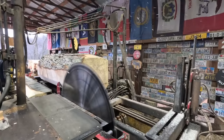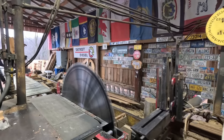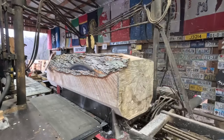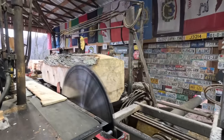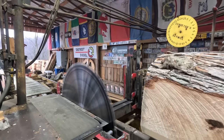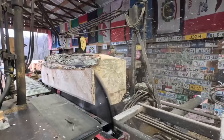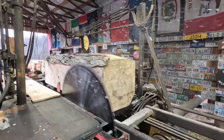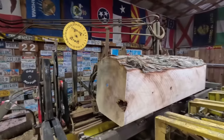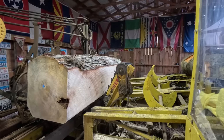There's been very little waste on this log, really. I think this run's going to take me down below my 22. That's a lot of log. I think we calculated over 300 feet. Okay. We're going to get into some rot right now. Well, let's run that front out again. All right, we're gonna go around one more time. We're getting a nice square cant formed at the same time here.